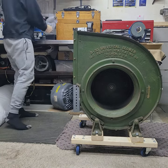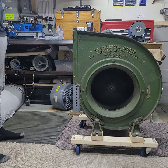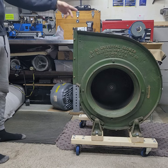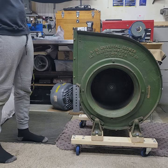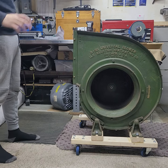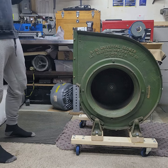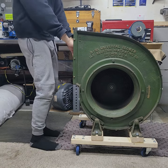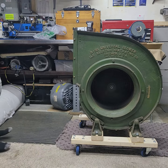So now, as it sits, I'm drawing about 2.8 amps, 2.7 amps. This is on a rotary phase converter, so this is running the idler. I have a 2 horsepower idler motor, and this blower is running, and all of that together is drawing 2.8 amps from the wall at 250 volts. So if I push this restriction plate down all the way to the bottom,